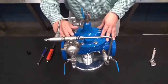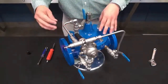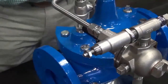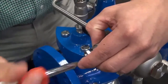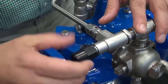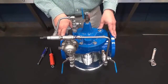So now we have confirmed the setting on the pressure reducing pilot. Now we will get to the speed control — the CV. This one here is an opening speed control. There is no pressure range or speed range that is given to a CV; again, it is based on the characteristics of your system. But you can give it a couple of turns to start — maybe one or two turns — lock the jam nut, replace your cover, and that is the setting of the CV. So now we have the CRD set and the speed control set. Now you are good to go.